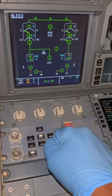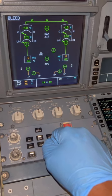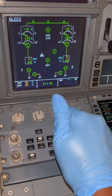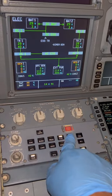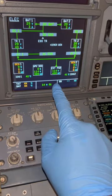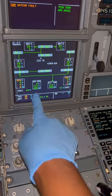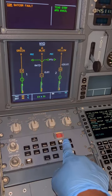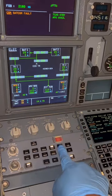We need to make sure that all systems depending on the APU are off before we shut down. APU bleed valves are closed, APU packs are shutting down. Once they're off, we can safely shut down our APU. Checking the electric page — make sure external power is connected and the APU generator is disconnected, or else we'll go lights out. APU generator is at zero percent and disconnected.